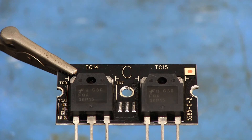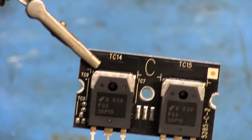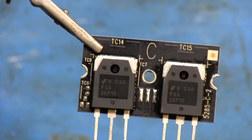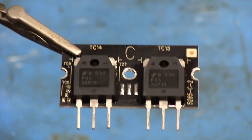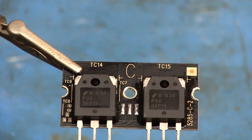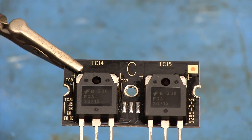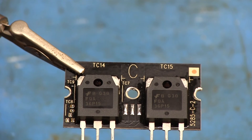Now I'm going to remove the heat and just let it cool. The two components are in place — they've cooled off and solidified pretty quickly so I don't have to worry about them falling off. They're pretty well mounted on there. The alignment on the one on the left looks a tiny bit crooked but it's not bad — it'll work just fine. The one on the right looks a lot better. This would be better suited for doing in a reflow oven, which I don't have at the moment but it's a pending project.